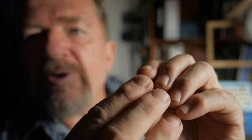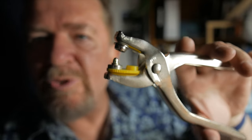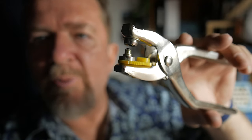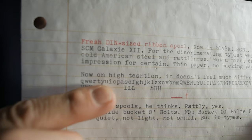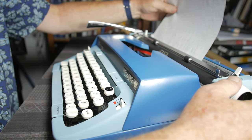The only thing is I had to add some eyelets. So I have this old eyelet crimper that I bought years ago because I used to fly kites a lot. I used to put little eyelets on the kite tail to be able to use quick-disconnect fishing tackle to remove the tails. I'm using these little crimp-on eyelets — they come in a little kit with different colors. You put it right in there and crimp it on the ribbon, but it helps to poke a hole in the ribbon first using a sharp awl or punch to puncture the fabric, then crimp it with this tool. The reason you need eyelets is because the Smith Corona uses eyelets for the auto-reversing system, whereas Olympias use ribbon tension and don't need eyelets. After I changed the ribbon last night, that's really nice and dark now, even on this really thin notebook paper. The type alignment is actually not bad. Let's do a little test typing.